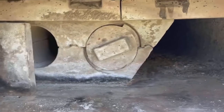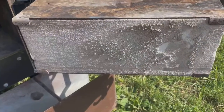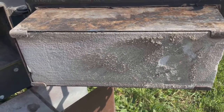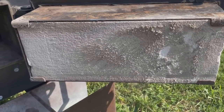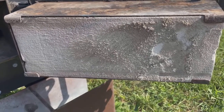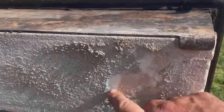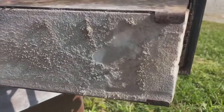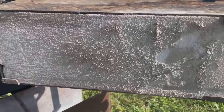And next we will get the supplied ash tool and clean that out. Now, do not try to scrape the ash off these insulation boards. Actually, if you leave it on, it's a better insulator yet, and it'll save some wear and tear on the board. It's not hurting a thing leaving it on there. I mean, it's not hard to remove, but you don't need to. Just leave it alone. It'll help protect the board a little.